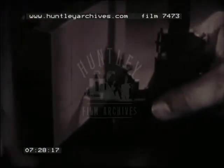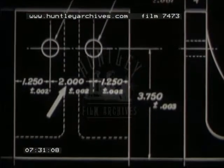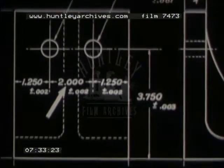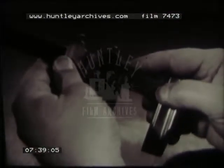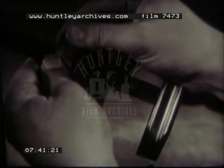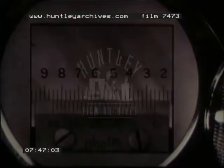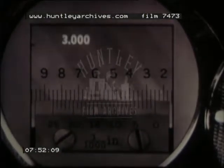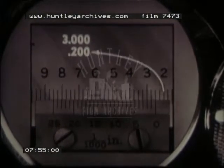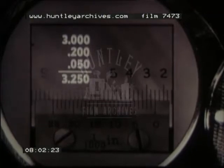The center of the other hole is to be 2 inches from the first one. Set the height gauge 2 inches higher. The zero index on the Vernier scale should be at 3.250 on the main scale. 3 from the inch graduations, 200 thousandths from the 10ths graduations, and 2 of the .025 divisions, 3.250 altogether. The final line is scribed.